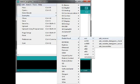modules that we're using. So now, if you've installed the library correctly, and if you go to your file examples, you should see a new section, RadioHead. And if you go into RadioHead, all the different wireless modules that you can now control are available. So go into ASK, and the two that we're going to use are ASK receiver and ASK transmitter. So you need to upload one of these to two separate Arduinos. So one is going to be your receiver, one is going to be your transmitter, and then we'll test it out and see does it work.